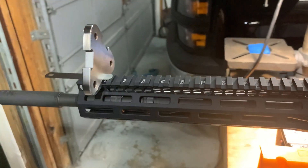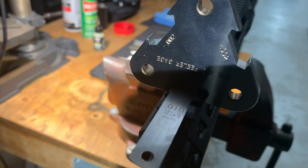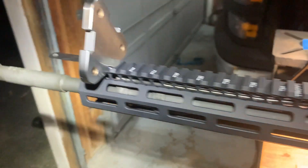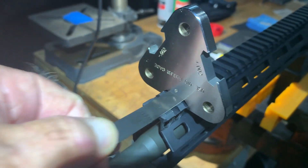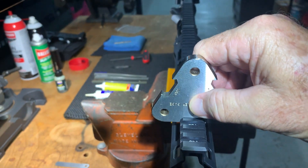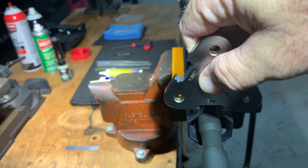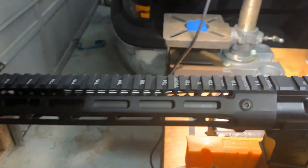I have four Midwest Industry rails. They all pass, but they have to go into the larger .002 slot, but that's good. But this Troy rail is the only one that is a perfect fit — it takes the ten-thousandths feeler gauge as it should, and it just slides perfectly down the rail, and it will not accept the negative two side. Perfectly machined Picatinny rail.